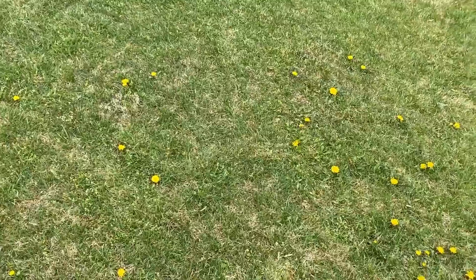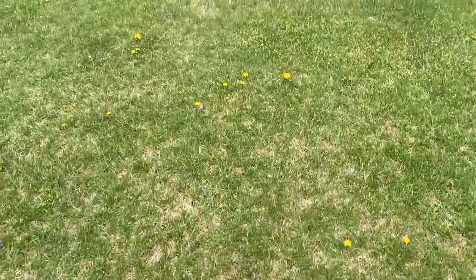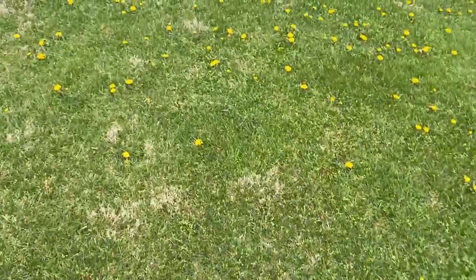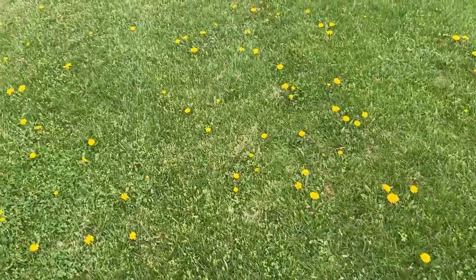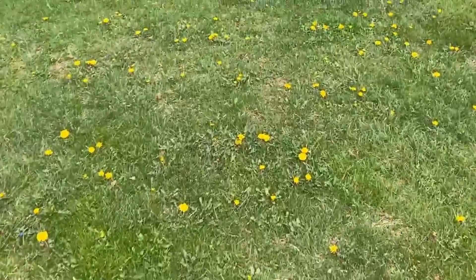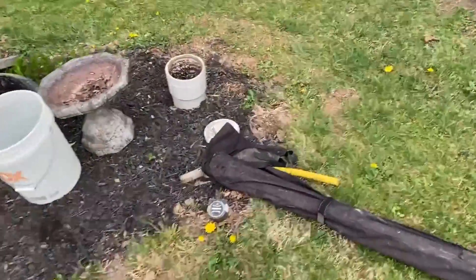If you're ever curious about where your septic system is, the first step is to reach out to the local county health department — they should have records to help you identify whether it's in the front or back of your yard. If you're lucky you'll have access risers like this property and it's a lot easier to find. On older homes everything may be buried below the surface. If walking the property and checking records still doesn't work, contact a local professional — they'll use a camera with a locator, running it from the home through the sewer pipe out to the septic tank to identify exactly where it is.